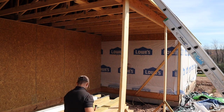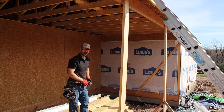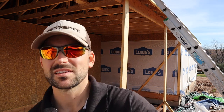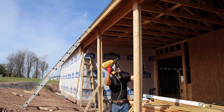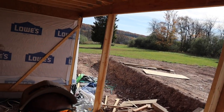I'm going to measure the distance from the top of the truss down to the base for our temporary post — that's 112 and an eighth inches. The next one is 119 and an eighth. Let's get those cut. The post that's already there is nailed to the actual beam; these new ones are going to be under the beam to catch the weight coming down.